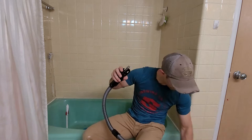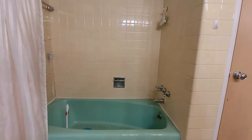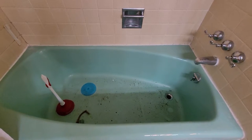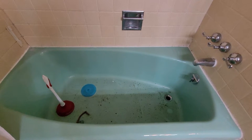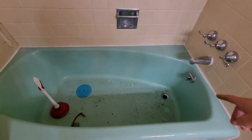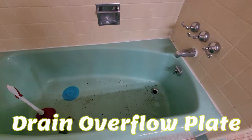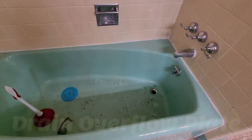Now I want to show you what we're dealing with here. Here is my bathtub — the brown specks are part of the clog, mostly rust flakes, and that's what tells me this is going to be a bad one. Those little pieces of metal came back up when I tried to plunge it. When dealing with a bathtub, you don't want to go straight through the drain hole. You want to remove your end cap for the lever, take that piece off, and that's where you'll be entering with the cable. I'm going to add a little water and see how this power cleaner works.